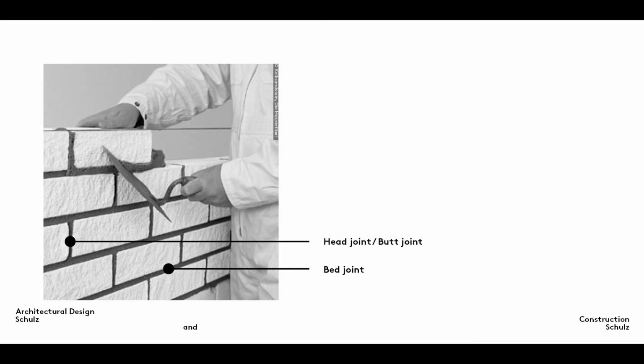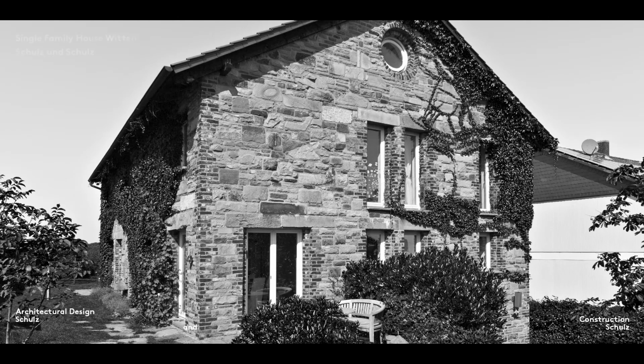The depth of the mortar joint depends on the consistency of the mortar and the method used to lay the bricks. Mortar is scooped out of a mortar bucket and spread or buttered over the surface of the brick or block using a bricklayer's trowel. The depth of a mortar joint can also be used to compensate for variations in brick and block dimensions, particularly in the case of irregularly sized fieldstones.